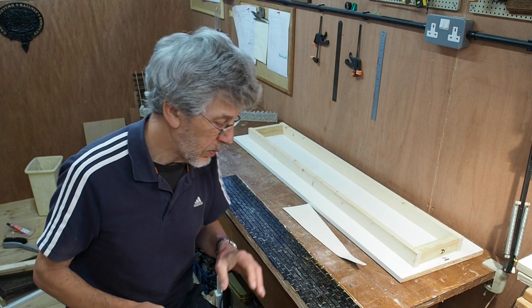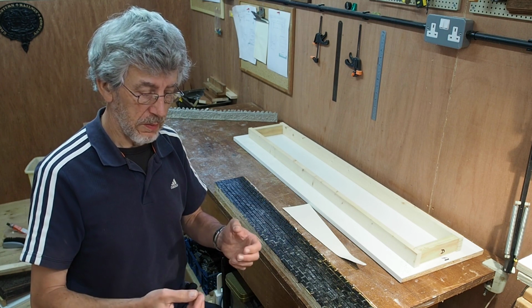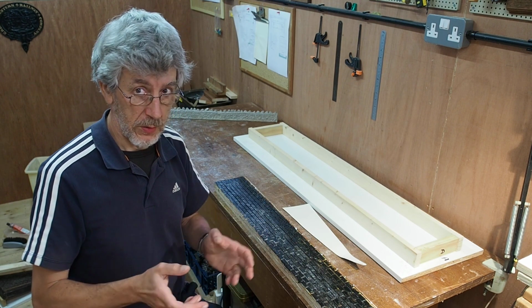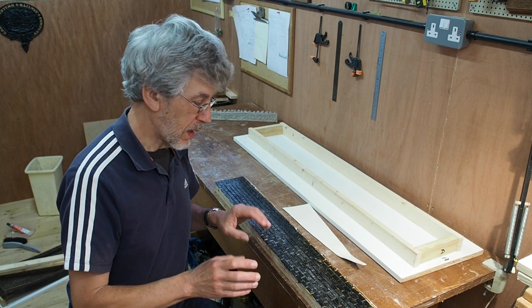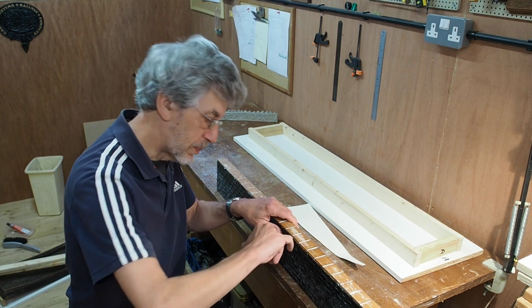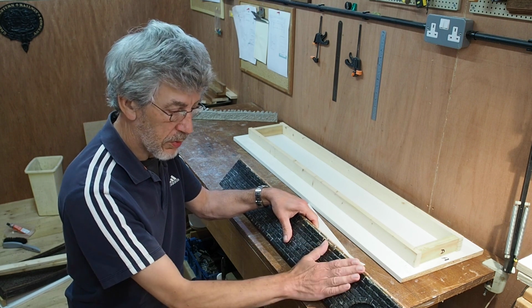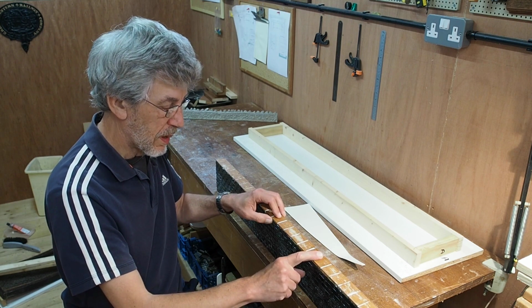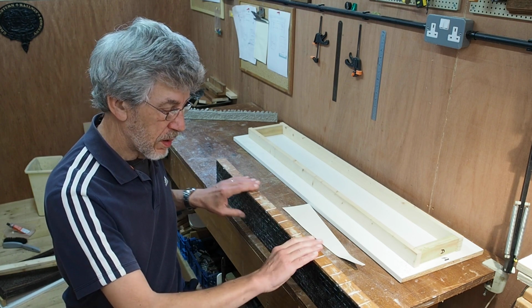One thing to be aware of with the rubber is that although it ends up very rigid, very tough and very solid, when it's being poured it is very liquid. It will get into every tiny little corner. That's great from the point of view of picking up the detail. It's capable of getting down behind these blocks if you don't seal the whole thing, and similarly it would get underneath these paving slabs at the top there. That's recoverable, but it's a bit of a pain, so you want to seal the whole thing as much as you can.